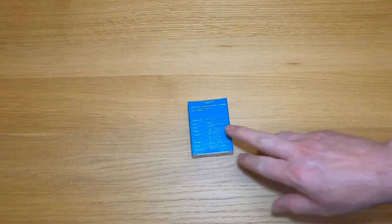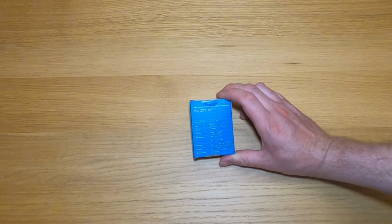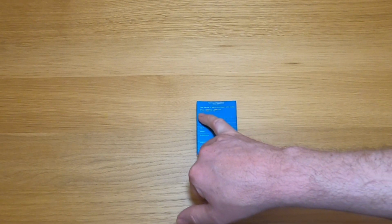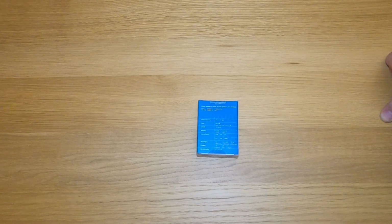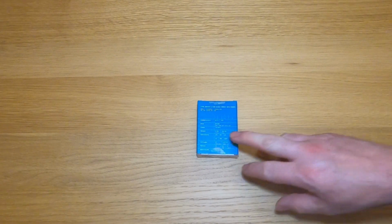Connectivity: Wi-Fi and BLE, Bluetooth Low Energy. And that's based around the ESP32 microcontroller, which I've covered in an earlier video. You can find more about that there. The chip is the RP2040, and that's a dual core ARM Cortex M0 Plus, and quite relevant, it says "small, powerful, connected, to the power of 2." Not sure whether the power of 2 is the combination of the RP2040 and the ESP32, or I suspect it may be because of the dual core in the processor, but either case.